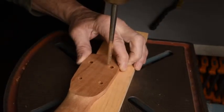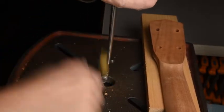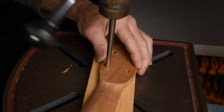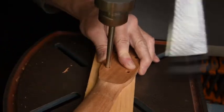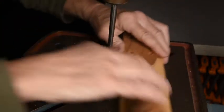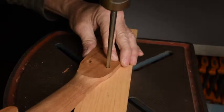There is a violin peg box repair method where a grain-oriented wooden plug is glued in, re-drilled, and reamed. If you really mess up a hole, this is an option — find an experienced violin repair person to do this job. This is also an option if you would like to fit a set of these pegs to an existing instrument whose holes are already too big.